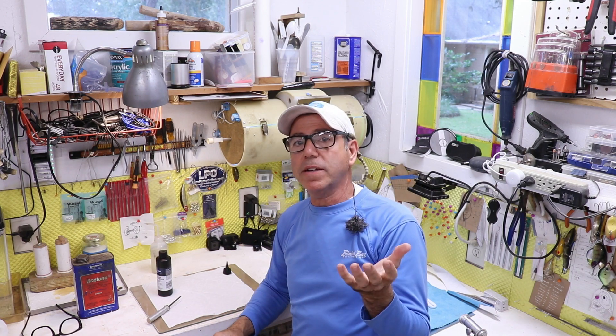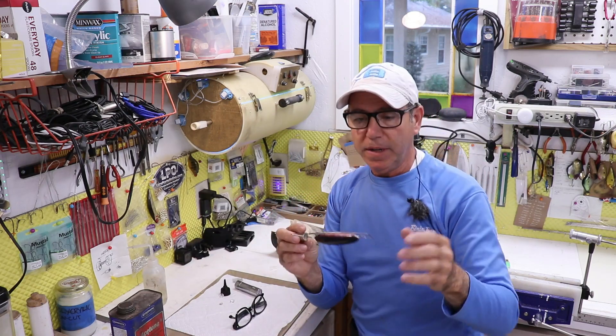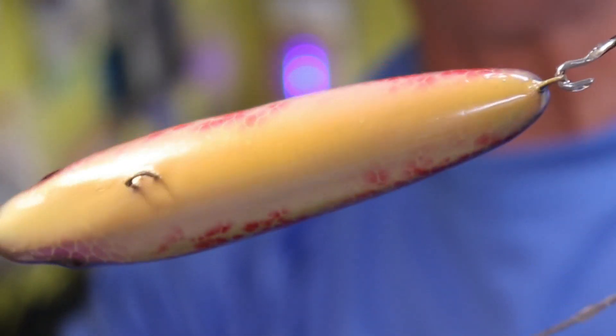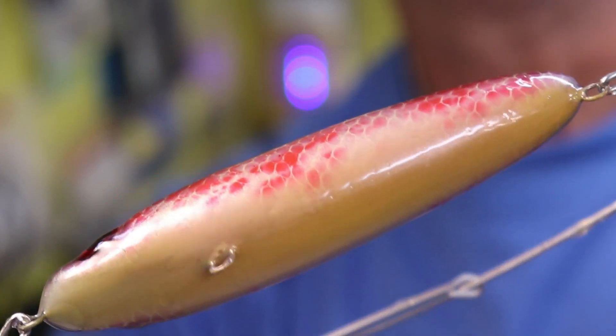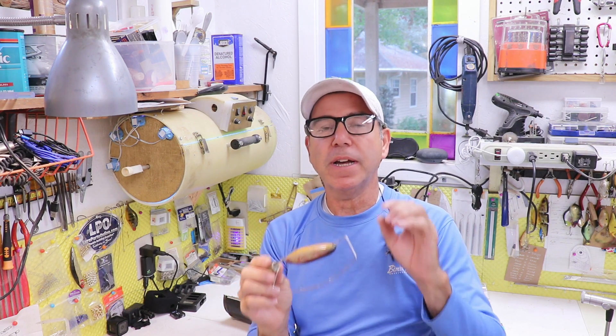After five minutes it's hard to the touch, but you can smell that it hasn't really set — that's another way to know if it's fully set, because a lot of times it'll be hard to the touch but still have a pretty strong resin smell. After my 30-minute review, it's rock hard. But the one with the new paint job is just a little bit ripply. You can see it right there in the reflection — that's typically what I end up with if I don't put a mid coat on.